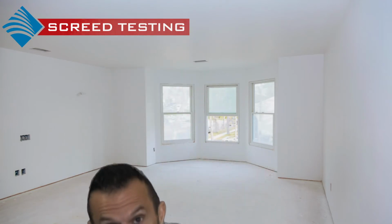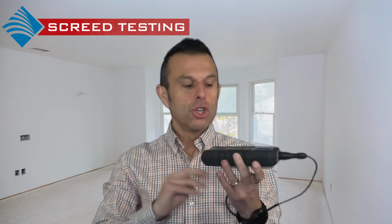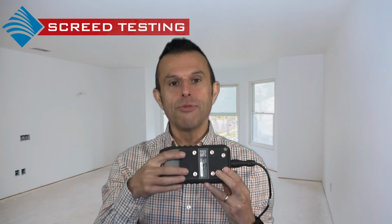A non-destructive moisture test can be carried out using the CMEX 5 meter, measuring quantitative moisture content percentage. The CMEX 5 also provides carbide bomb method equivalent.